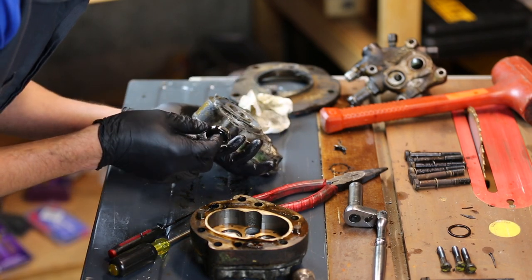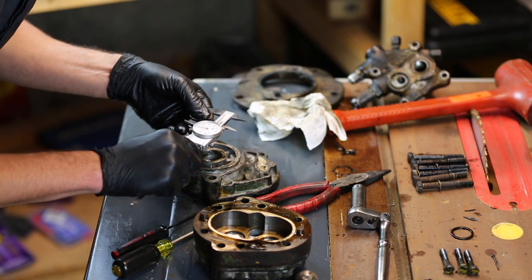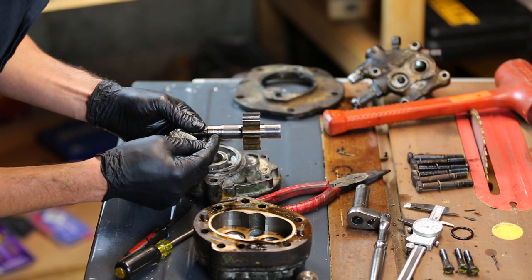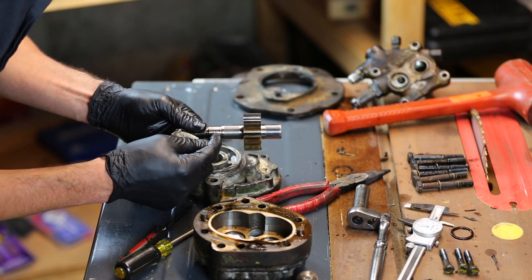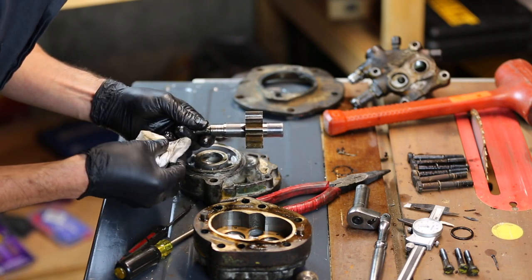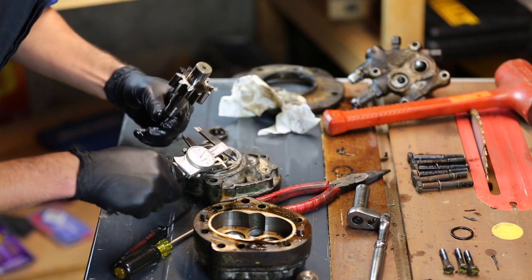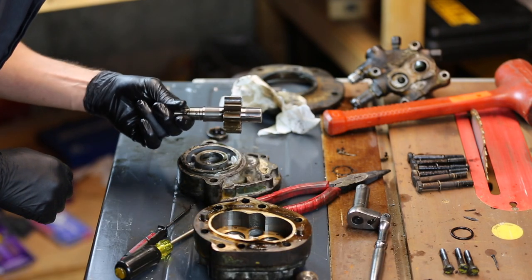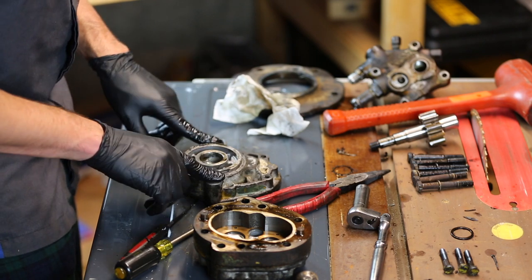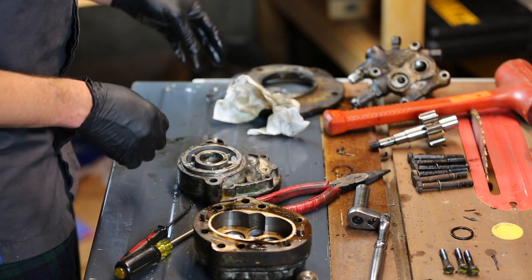There it is. The outside diameter of this seal is about 1.248 inches. There's a shiny spot on the shaft where the seal was rubbing against it — so that's worn out. That's probably why it's leaking: a worn shaft plus old rubber on the seal that wasn't doing a good job sealing. The shaft is exactly three-quarters of an inch, so that should be a pretty easy seal to find. I'll check McMaster-Carr — they have fast shipping and should get it to me within a day or two.